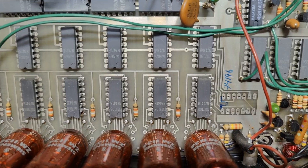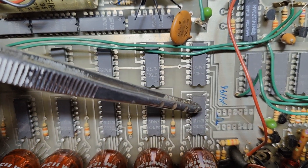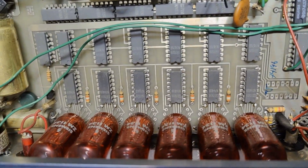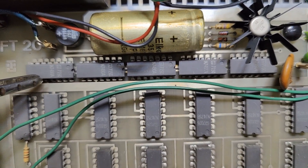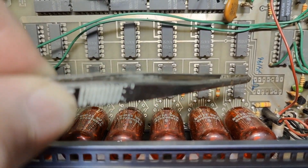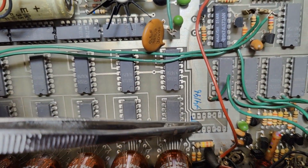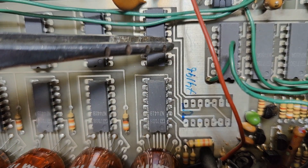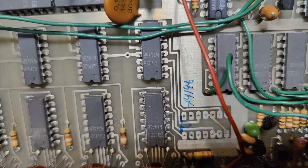Let's look inside the circuit board. This is IC1, and the four bits from that go to the first latch. The latch goes to the Nixie decoder driver, then latch, driver — the same for all of them. Up here we've got the other digit counters — just the normal 7490s. If you count here, we've got six tubes, six Nixie drivers, and six latches. But we've only got five counters up here, because the first counter is that special one — IC1. There's probably a special reason for that, maybe it's faster. But without this one, nothing happens, so we better go and get some.